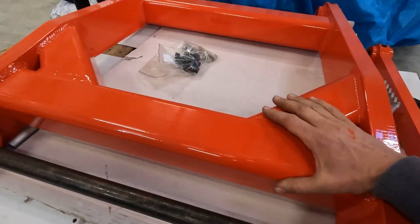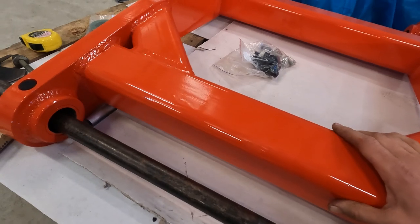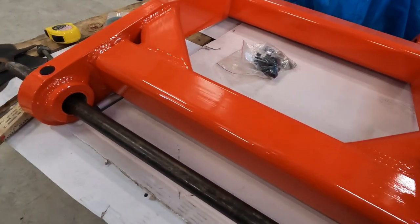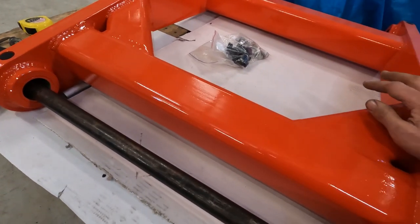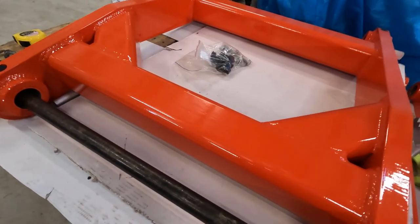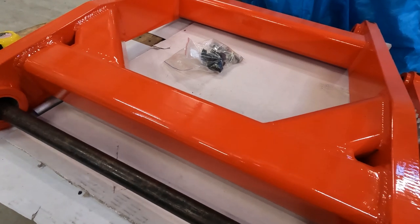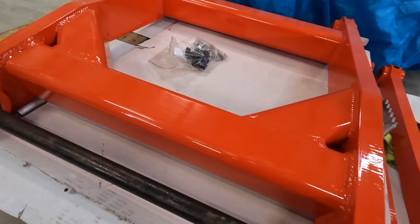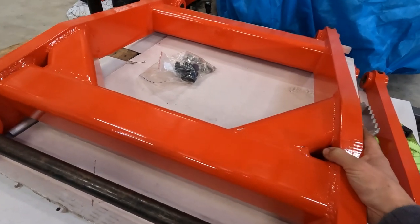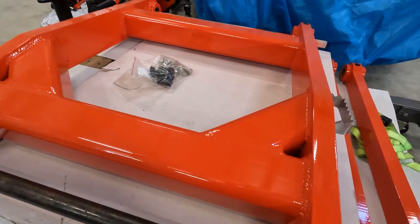And what I've done, I've put these braces in here, which I think were 10mm thick, 100 by 100. I set this up on the spare parts machine so I knew where to put these braces as not to hit the drawbar on the machine. So obviously doing all the pulling this is, and you also wanted to stop it from doing this as well.